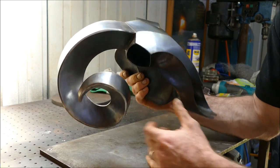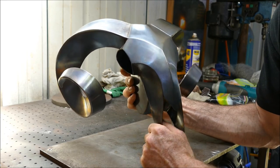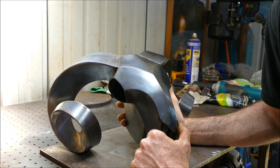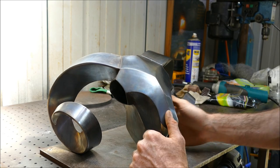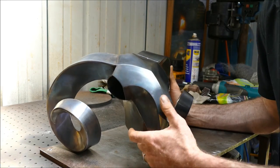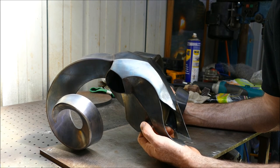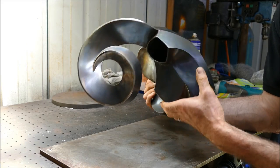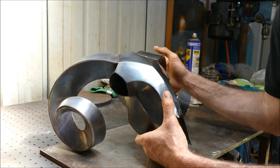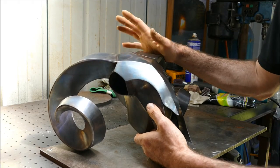But do bear in mind that if you're going to choose to do gun bluing yourself, it takes a very long time. As you can imagine, all of the different grits of sanding, even putting the solution on itself, is taking me several hours. Would it be my go-to choice of finish? If the client wants it, yes, but it's an expensive one because of the amount of time that it takes. My choice of finish for normal projects is really to get things hot-dip galvanized, and then I've got a special blackening solution that I put on top of that, and it works instantly. It's very quick.